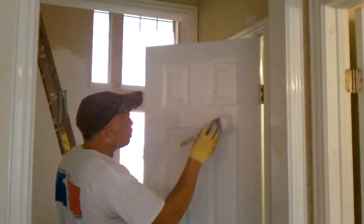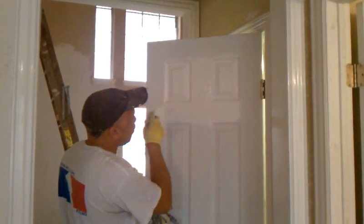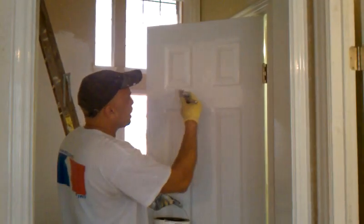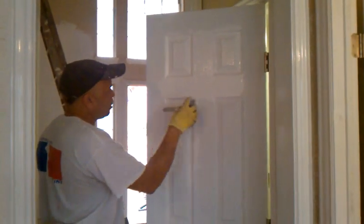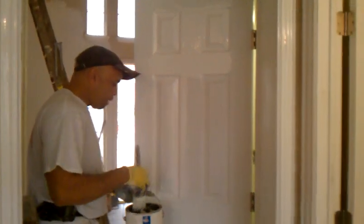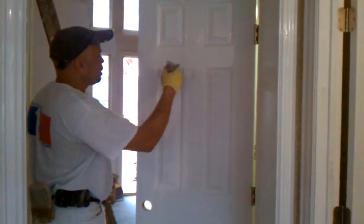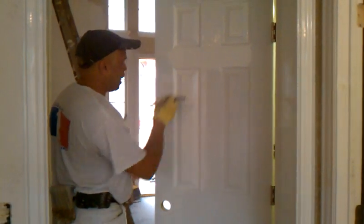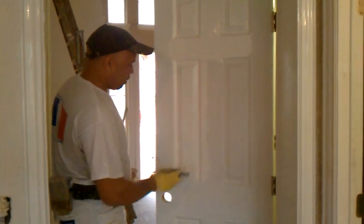I come down here, go to the next section, and then I come here and do this out to there. You come back so you've still got a little bit of time, and then you just keep going. Dip the brush in the oil base paint. And if your oil base is setting up on you too quick and starts dragging, you need to thin it down with some paint thinner — that will help give you a little bit more longevity with the paint.